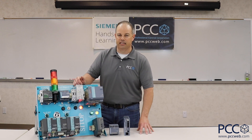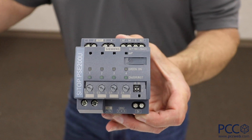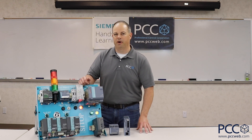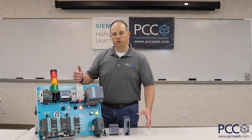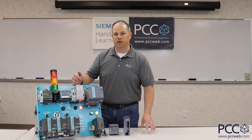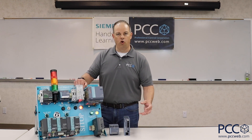Where I want to go today is the diagnostics capabilities of the Siemens electronic diagnostic module. If you have a short circuit occurrence on the output side of your power supply, you are crowbarring that power supply. What that means is the power supply is going into a protection mode and it's not supplying any of that 24 volt DC power out to the circuit anymore. The trouble is, from a design perspective, on the output side of a power supply you'll see miniature circuit breakers or fusing breaking out the control circuits, but these devices don't pick up those small issues and they don't trip — so you get that crowbarring effect.